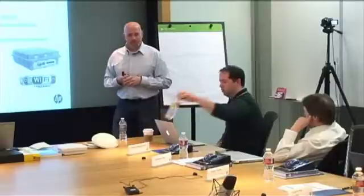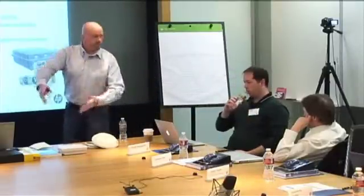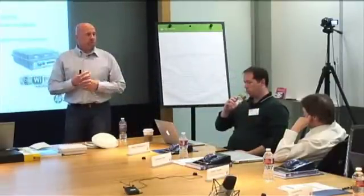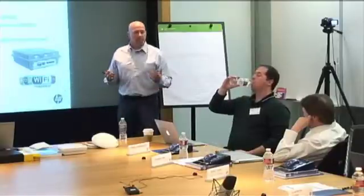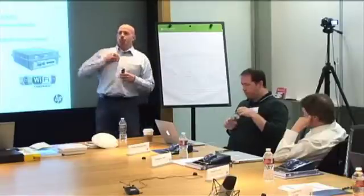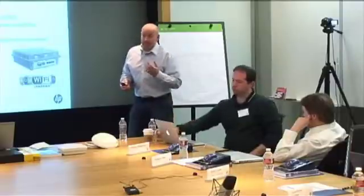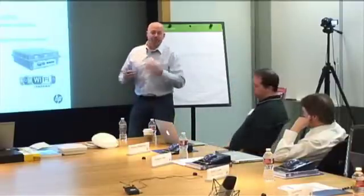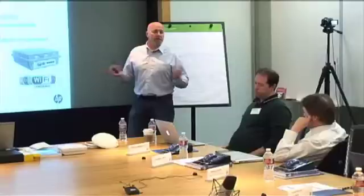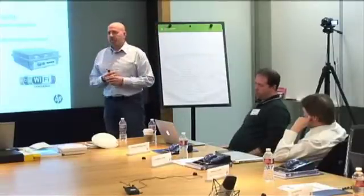It is a marketing stretch, but like I say, to explain it again, we can get a cell that will support 900 megabits worth of bandwidth, and it's a shared medium. It's not an individual medium. Yeah, I see what you're saying. Because at the max, one client is going to get 450 megabits if they have a 3-stream radio in their client.